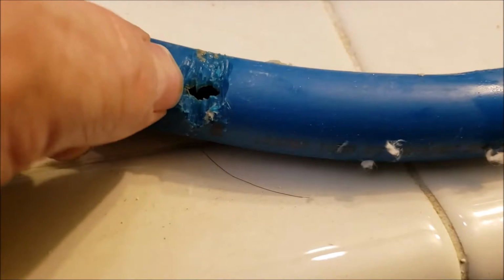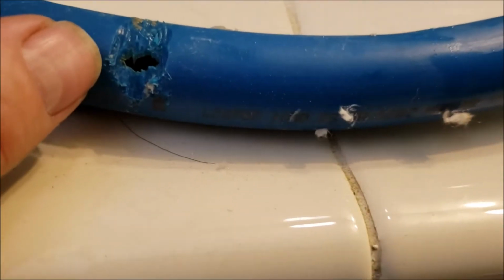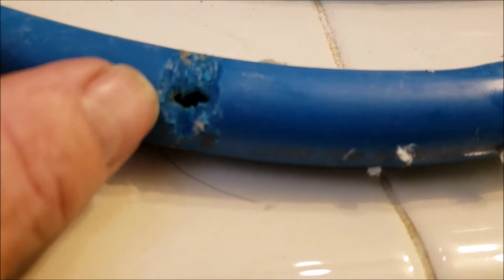So still here in Clovis, California, and this is the 4th pipe that we've taken out. And of course, same thing, chewed through. So live, active rodent or rodents in the attic. And we've urged the homeowner and the tenant to get that taken care of as quickly as possible. That's outside of our scope of work. We checked around up there for lines connecting to this, and we didn't feel anything, but you could see the water all the way on the outside wall, saturated. The whole joint line of the ceiling right there is coming apart, so that'll be a repair.